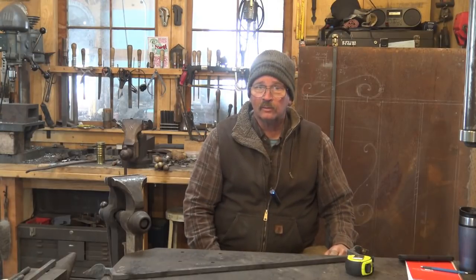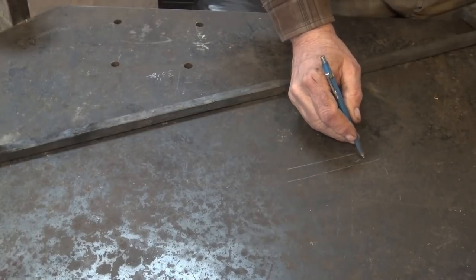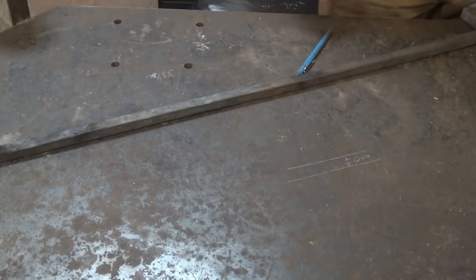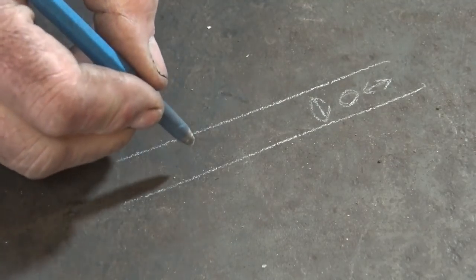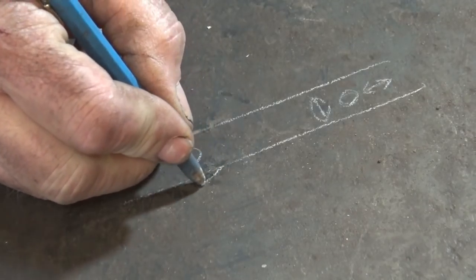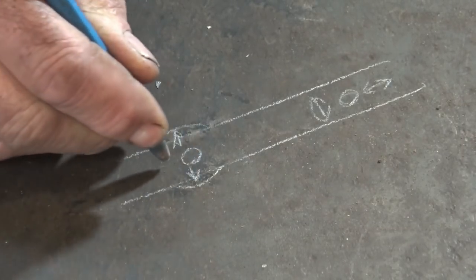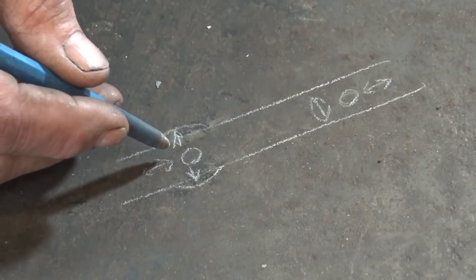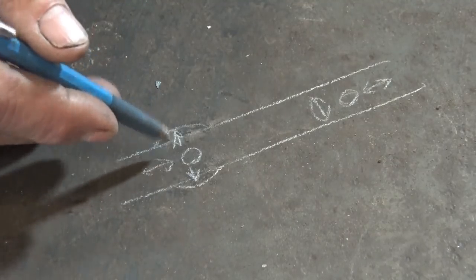Why would it grow or why would it shrink? If you have a square bar and you drill a hole, you remove material — there's no force acting in any direction on this square bar, not horizontally, not vertically, not in and out. But when we punch a hole, we aren't really removing much material. There will be a little slug that comes out, but not much. So that means if we punch a hole of the same size, this is going to swell up and move around that hole. What direction? We know this is going to go out — but think about what's going to happen here. Is it going to move in? Is it going to suck it in so this can go out? Or is it going to push out in all four directions? The other consideration is what happens to the side of the bar — what happens in this dimension? So we're going to have to look at all that. We'll punch our holes, we'll remeasure the bar, and we'll see what happened.